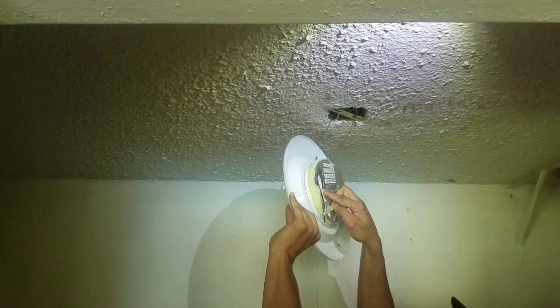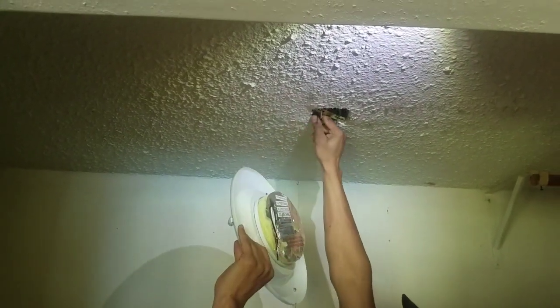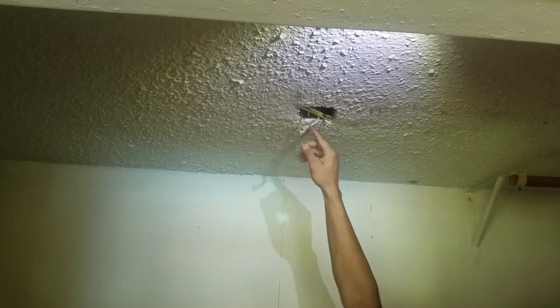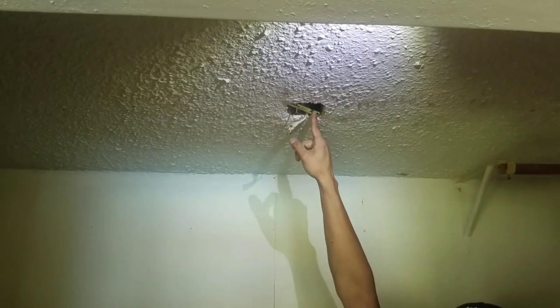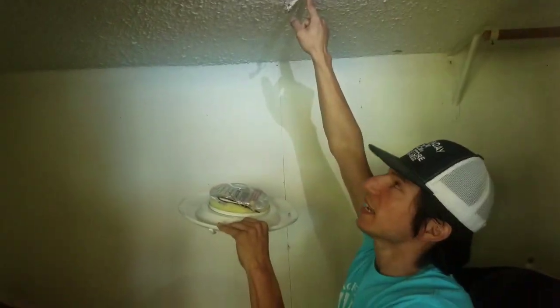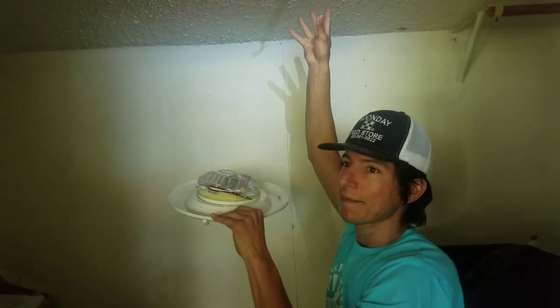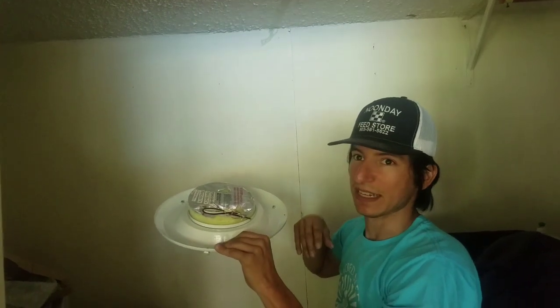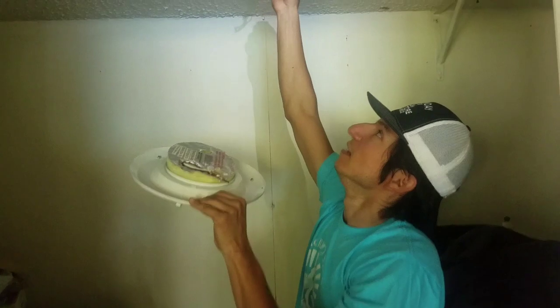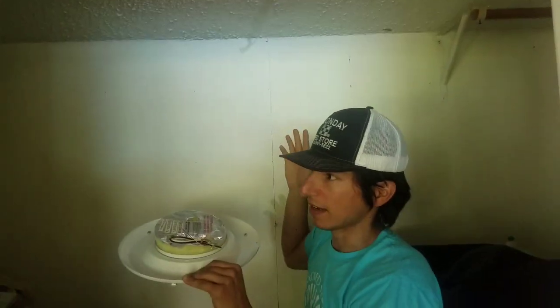connect this wiring, black to black, white to white, ground to ground. Ground should also go to the fixture base. You want the bracket, the junction box, everything that can be grounded, it's best if it is. If you want to cut a corner and just connect ground to ground, I won't say anything because I can't see you through the screen that you're watching me on.